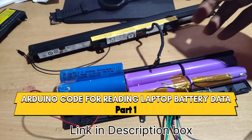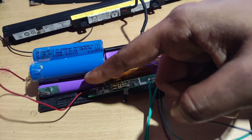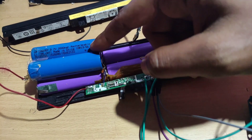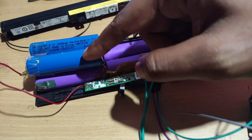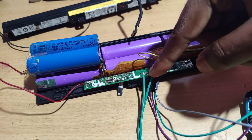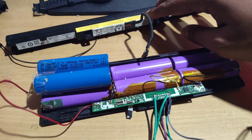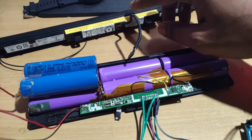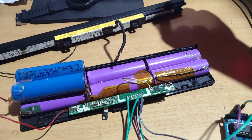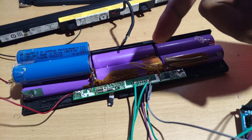I have two laptop batteries — one from Lenovo and one from Dell. The original batteries are dead, so I connected another two-ampere batteries in parallel to the boards. This board is completely dead and gives no output. The Lenovo battery board gives only 12V (total design output is 14.4V, four cells in series), and the Dell board gives 10.8V output, just like other normal batteries.